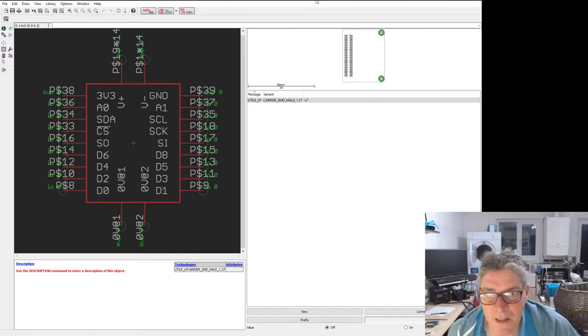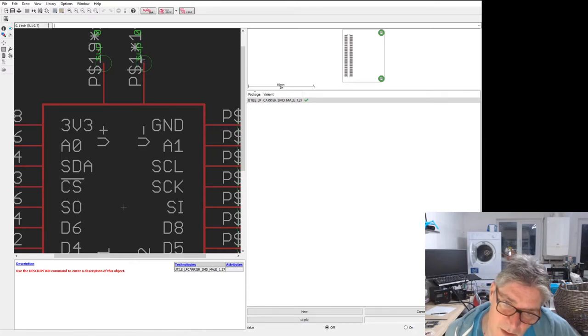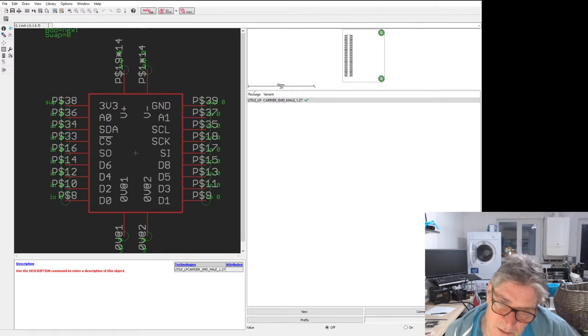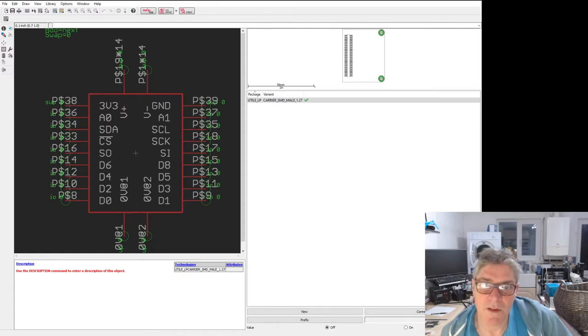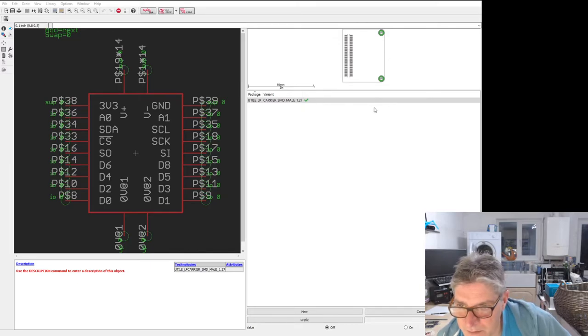And then in the diagram here, as you see, it goes from PS1 to 14 and 19. 19 to 14, that's a bit odd. So multiple connections go to these points, so they're appended to the same pin. But for some reason, some of these pins haven't been set up right when I did this.